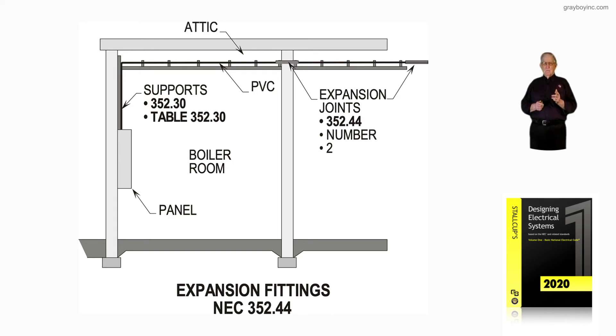They're saying 'keep away' — not 'keep out' — that is a different identification marking. And naturally, it's visible after installation where necessary for safe maintenance and operation procedures. The exception to 392.18H applies only where conditions of maintenance and supervision ensure that only qualified persons service the installation.